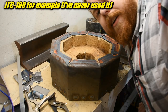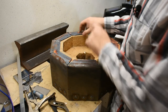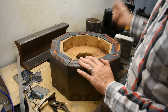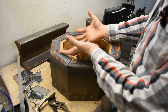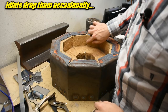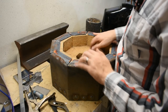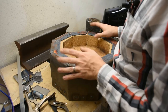All these people on the internet - you can't trust any of them. Not a one. Especially ones with orange beards. Anyways, this worked pretty good. The main reason I'm showing you the lid is that the lid gets much more abuse, so if the lid looks this good, the furnace looks better. I think the lid gets more abuse because you're moving it around more and the temperature soaks through it more. Now I mentioned this is too thin. What I'm going to do - not now, because my mixing jar is welded shut. It turns out satanite dries. It doesn't mortar bricks together real good, but man, it'll shut a mason jar. I'm not allowed to break any more mason jars - I already did too many of those.